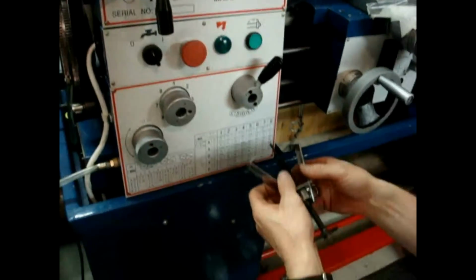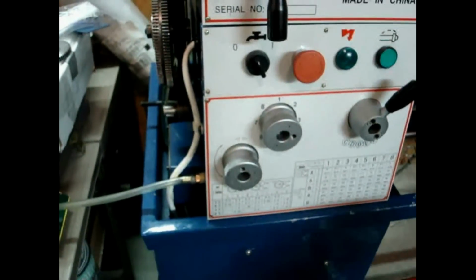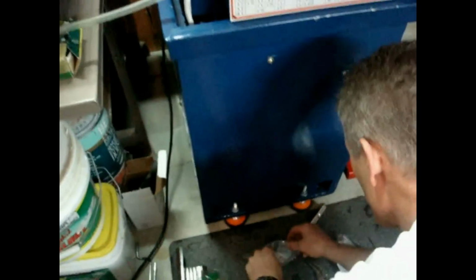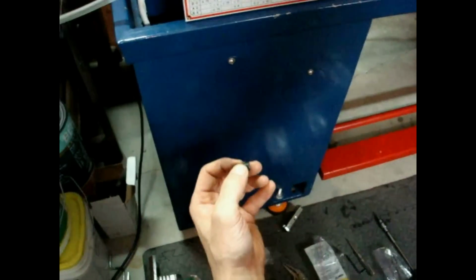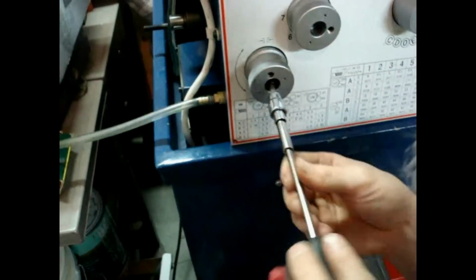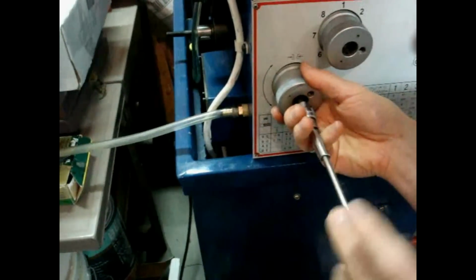Since these are on here to some degree, I'll start with the easy ones first. Whoops, and I just remembered something. The one that I have, unless you have a larger thing or can pull this pin out of here, I have to take one of the screws off like this and replace it in each of these holes. The cap head screw will only contact the shaft now that I've taken the washer off and not the handle. So this will allow me to use that as a post for my gear puller.